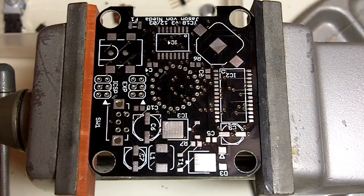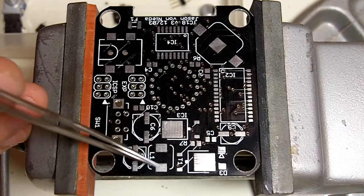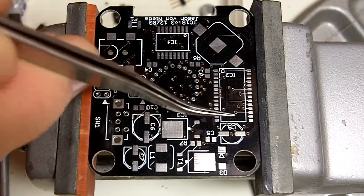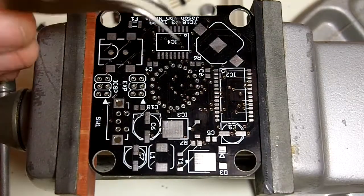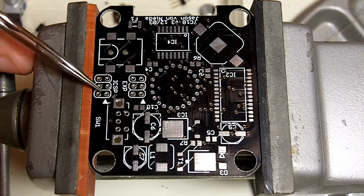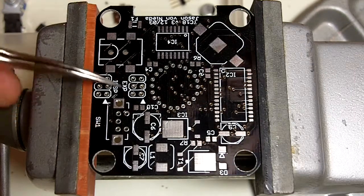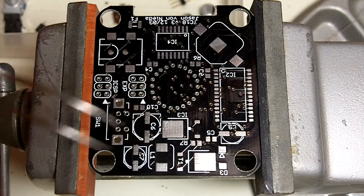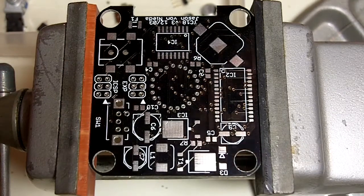We have, let me point out some sections. We have the high voltage power supply, which is most of this area up here. We have our low voltage supply here. This is our VFD tube driver chip, our real-time clock chip, power connector, pin headers for programming and expansion, rotary encoder, battery holder, and then there's a couple little 0805 components scattered through. This side should go pretty quick.